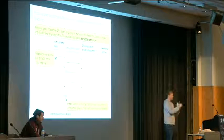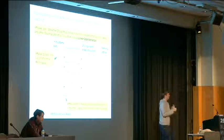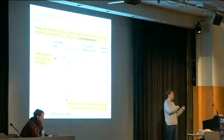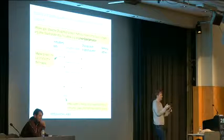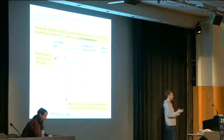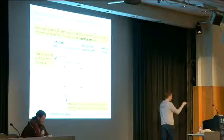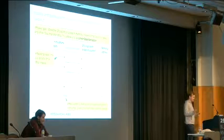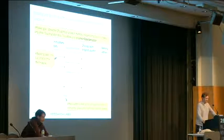It increments the program counter because it needs to move on to the next instruction, waits a little while for the memory to be able to populate the new instruction into this input buffer, and then triggers that the NOP instruction is executed. Is moved through this conveyor belt, right? And then whatever new instruction is in also executes its CPU logic.